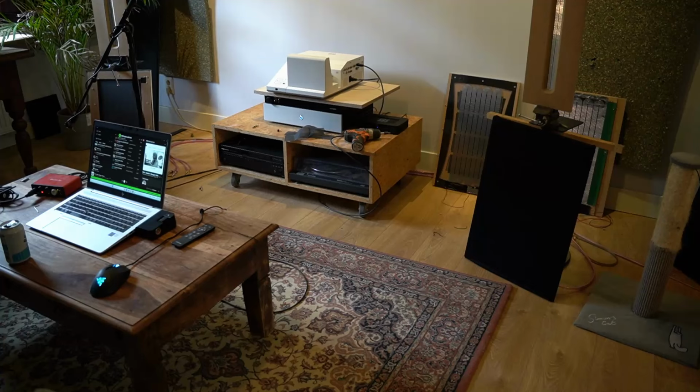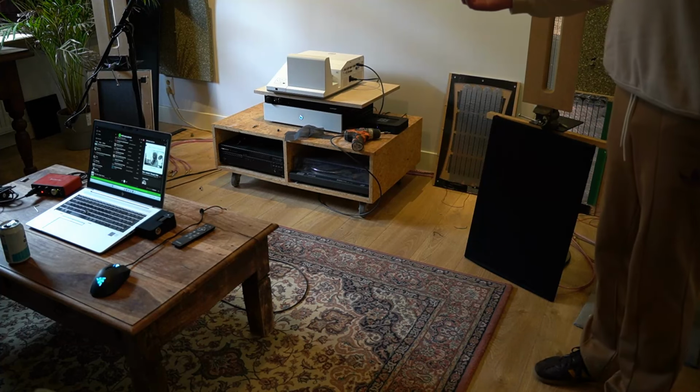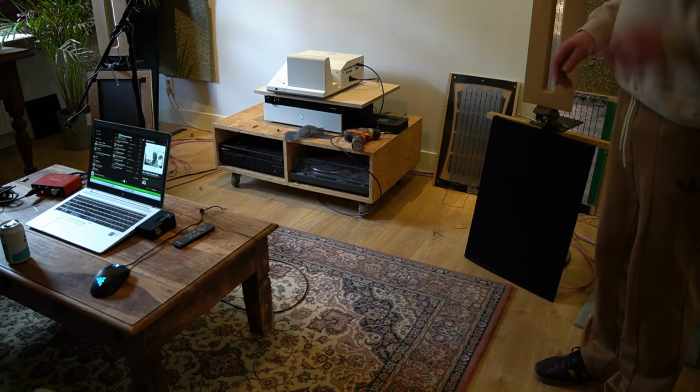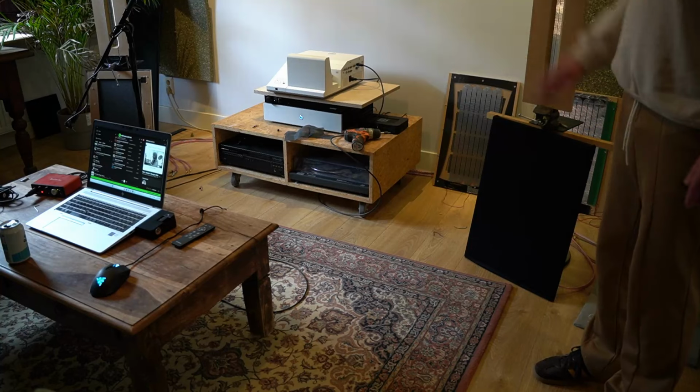I have a minus 8.5 dB on 51 hertz because that's my room mode. That's 8 or 9 dB you get for free. That's why the LRS, which does not reach down to 50 hertz flat, will in my room, just because my room is bass heavy. So I removed that for this one,